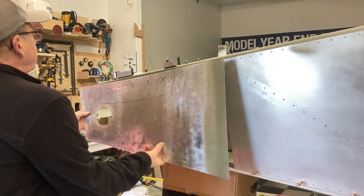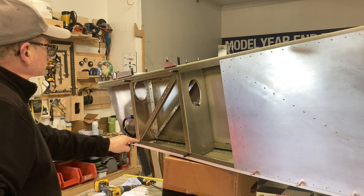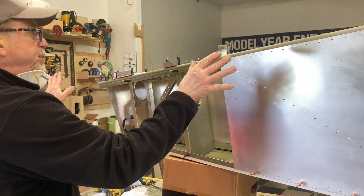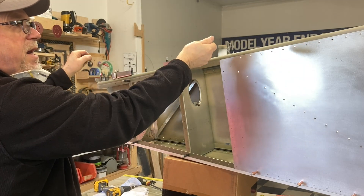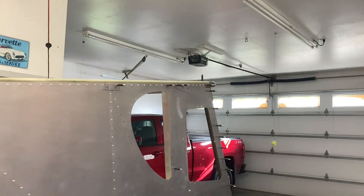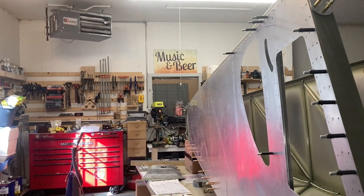This spring up here is under a ton of tension, so that's going to be interesting to get a rivet in. I could work it with the cleco wires and get it in, but these are very tight. It's still too long I believe, but it does work - you'll be able to get it together. Now what I'm going to do is let this side flex in and out when I go to put the top on. The idea is to slide those cross members under the left side and then manipulate this side in and out until I get the rest of them. I'll probably have to tip it out, make sure one pops in, tape it, and work my way along. Because I can still take this apart in the front right here, I can cleco and un-cleco and manipulate this side in and out pretty easy.